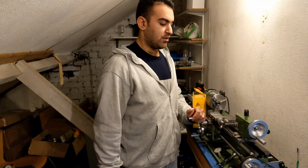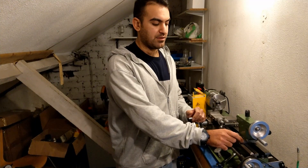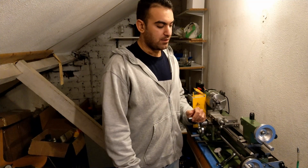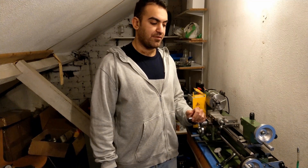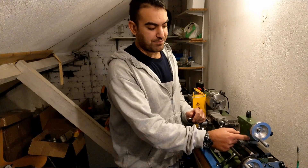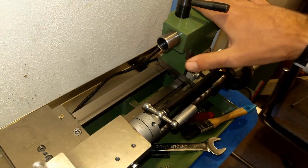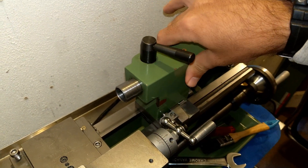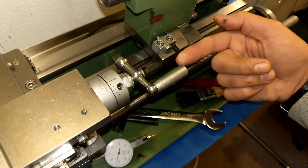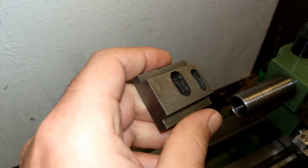Before I go to this feature, I'm going to first make a locking mechanism — a locking plate for the base. In my previous video I've done a few changes to my mini lathe, and one of the things I did was add a piece of plate. Having that plate on it helps a lot to keep the tailstock in line and it doesn't play as much as before. The reason the base was playing so much is because the base is so small — about six or seven centimeters. Here I have the original locking plate.